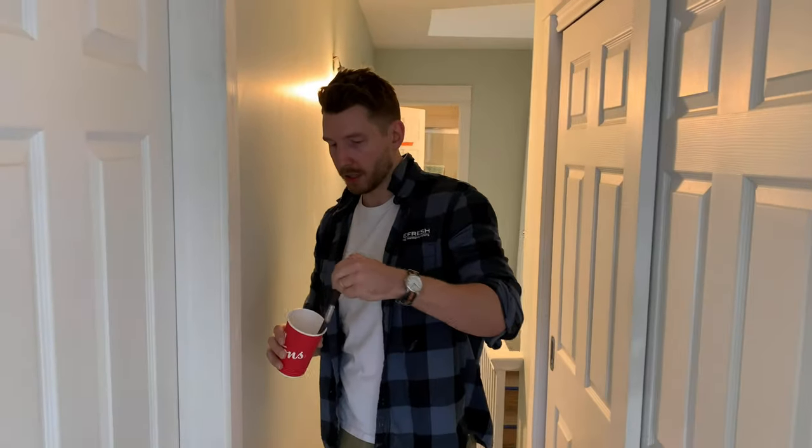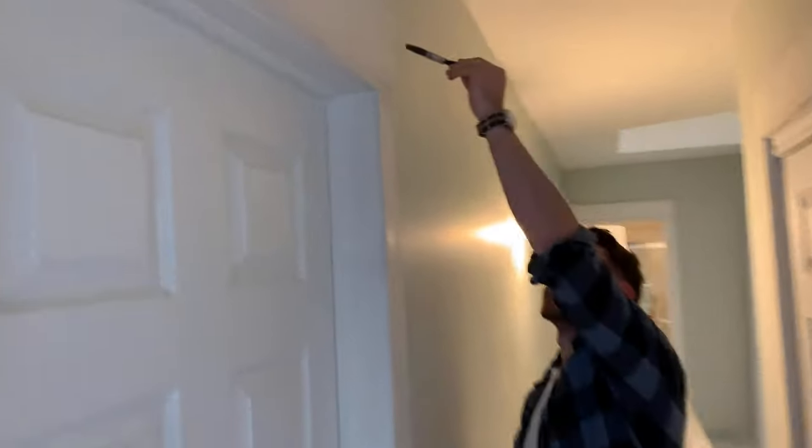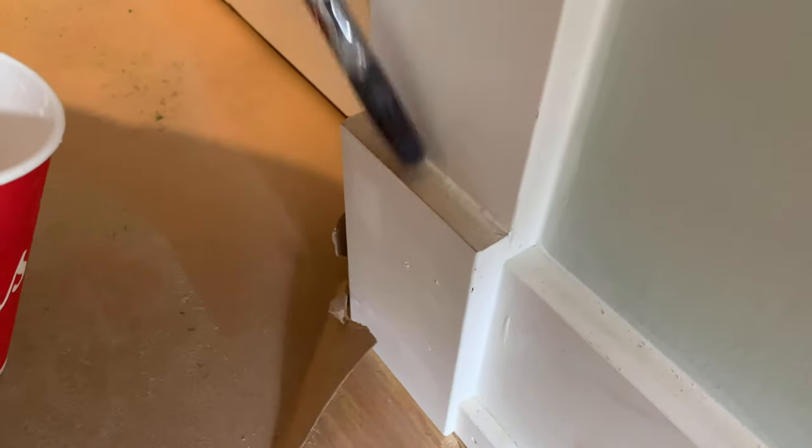Because it's exposed, it soaks up the moisture and leaves a rough texture like an end grain on wood. So we're gonna make it no longer porous by using this mixture of wood glue and water. Once I've applied that to all the exposed edges, we'll sand it after it's dry, then apply wood filler, paint it up, maybe a sand in between, and it's gonna be glassy smooth. We'll see.